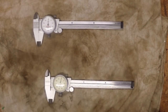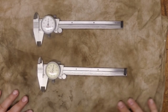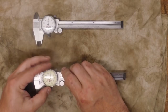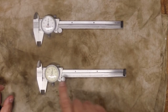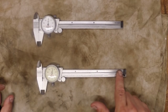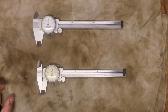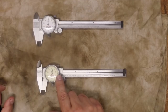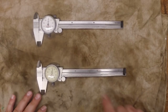All right, now you can see my two pairs — this is the pair I worked on earlier today, and this is the pair we're going to clean up here. If you notice, the dial isn't on zero on these; it's off by just a couple thousandths. Again, no big deal — you can always adjust these. That small offset has to do with the rack not being in the exact right place. If you loosen the screws on the rack and nudge it forward and back with a screwdriver, you can usually adjust that out. When it gets off by a tooth it's usually off by about 25 thousandths. Right now this one's not bad, but we're going to go ahead and take it apart.